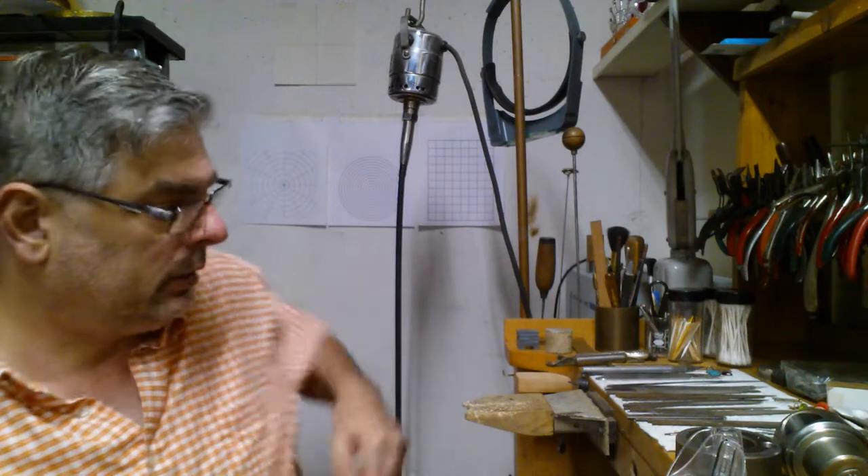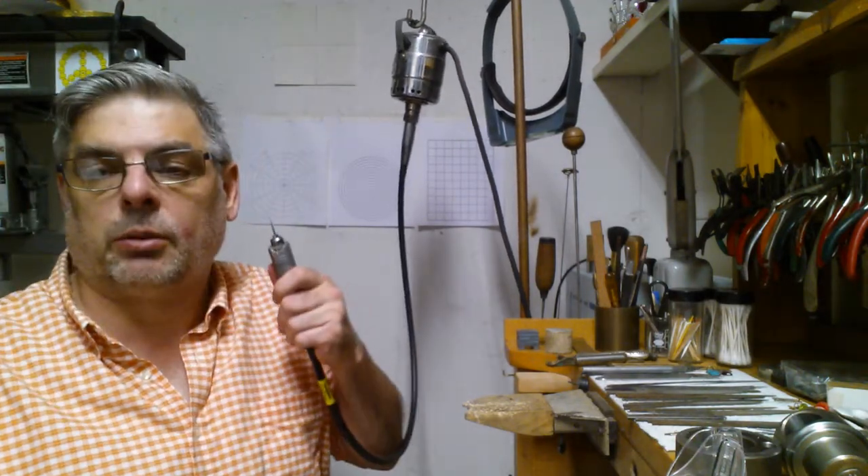This one also doesn't tend to be something most people think about: if you have long hair, you need to tie it back — either into a ponytail or up into a bun while you're working — because rotary tools will jerk it. But things like buffers and polishers can literally grab your hair and yank your head down into the spindle in less than a second. At worst, you'd lose a little bit of hair, but you can also lose pieces of scalp — I've seen one person experience that. And with that sudden jerk, it can cause neck problems. So make sure you tie back your hair.